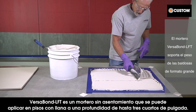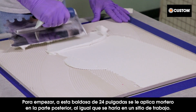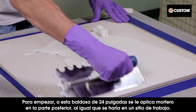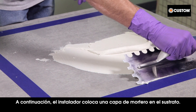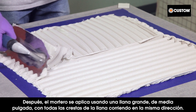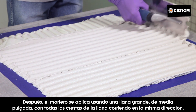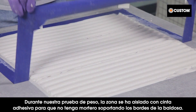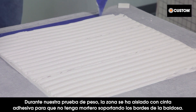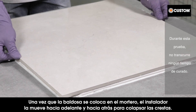To begin, this 24-inch tile is back buttered, just as it should be on a job site. Next, the installer keys in a burn coat of mortar to the substrate, then the mortar is combed using a large half-inch notch trowel with all trowel ridges running in one direction.